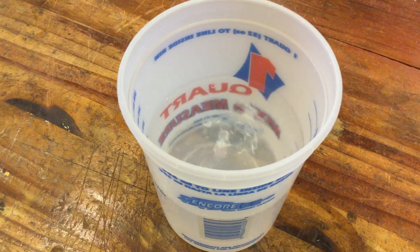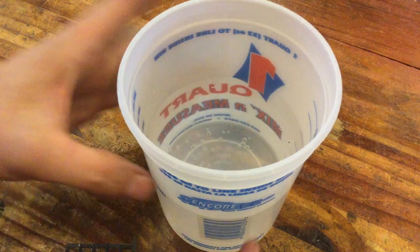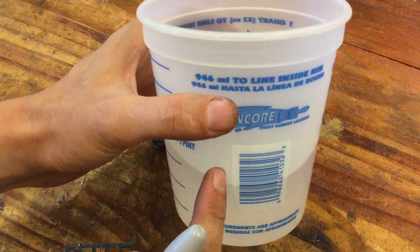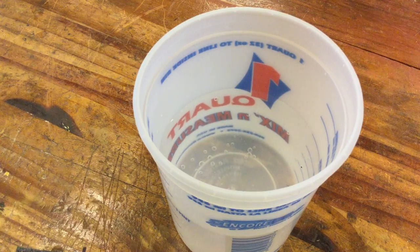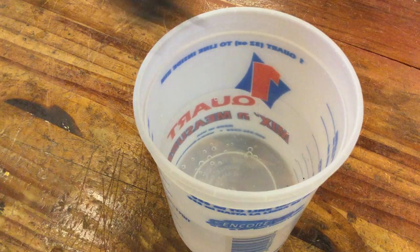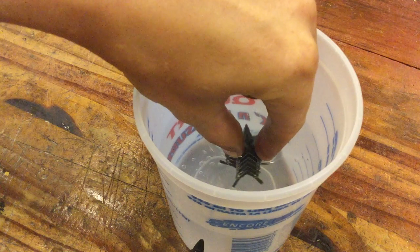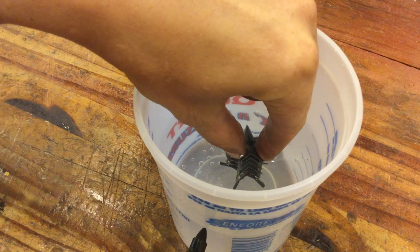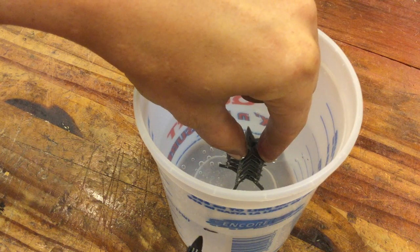So at this point we're going to use Archimedes principle. We're going to take this vessel of water and our printed part — you can see there are no marks on it for the water line. We're going to let it settle; it's just above a pint. What we want to do is mark where the water line comes up to when we fully submerge our part. There is our part fully submerged and we mark the index of where that water line is.